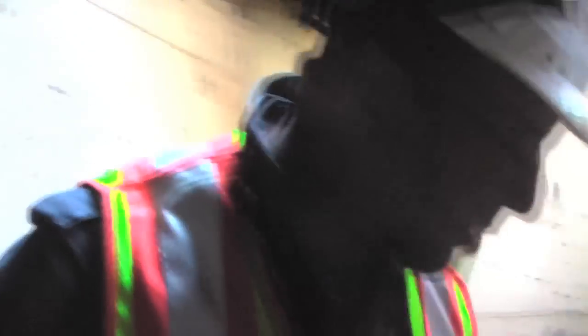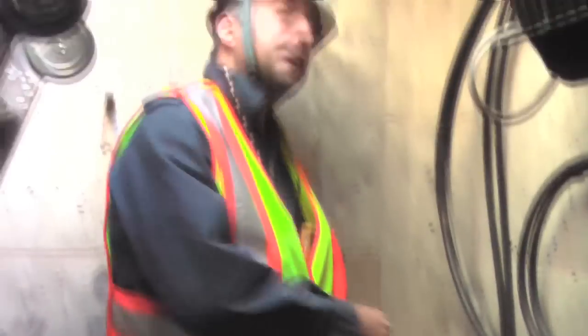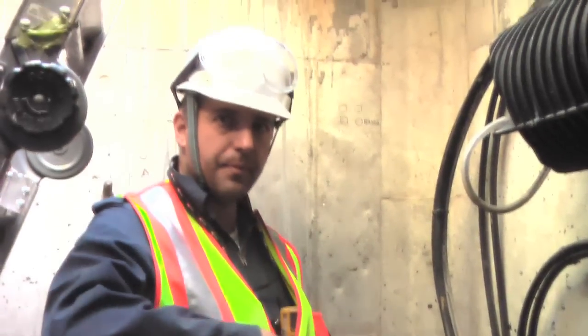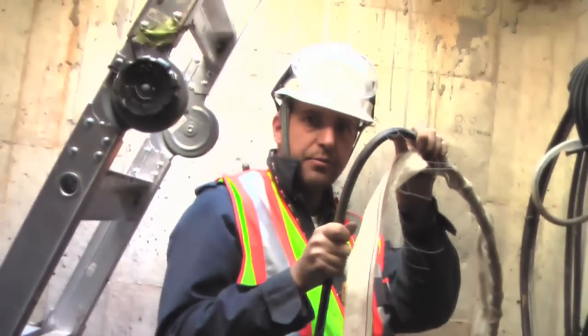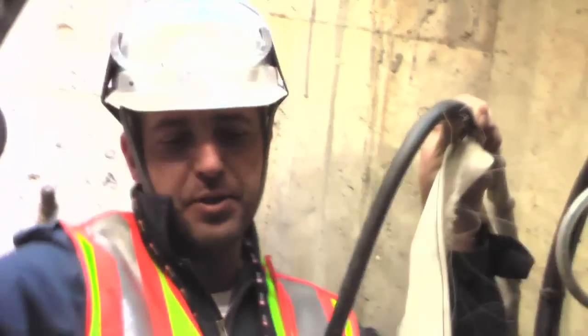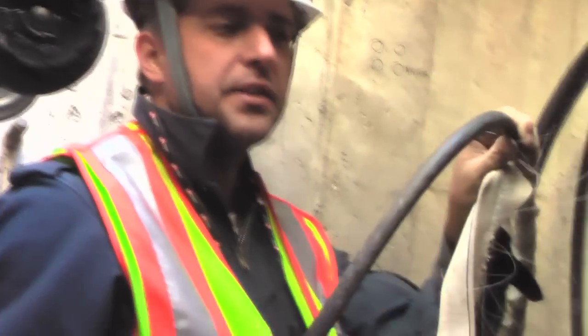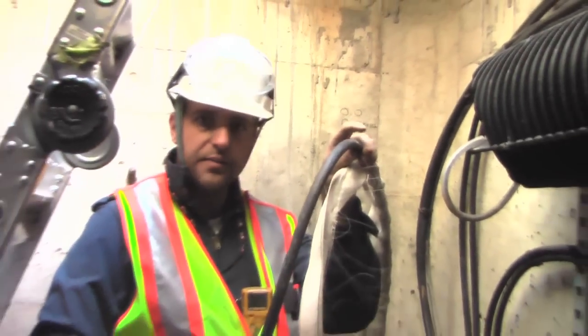Last time we pulled this cable in, it goes inside this fabric bed. When you pulled it, you pulled it up and then out the manhole — it was basically like this — and then it was like that at the top of the manhole again in the opposite direction. And this stuff has a minimum bend radius of 12 inches, which means two feet effectively.